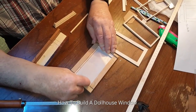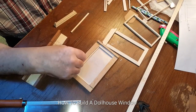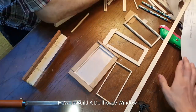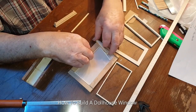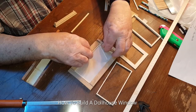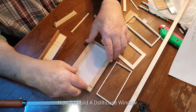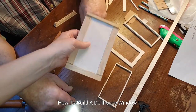And the reason that we make it a quarter inch longer is when we put the other pieces in there. Grab a piece of scrap here and I'll show you that I'm burying it. The piece of scrap will go in here and hold all this together so it doesn't swim around on you while the glue is drying. It'll go in there like that — you'll put one, two, three, four. Also, you're gonna want to line your jig with wax paper.